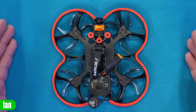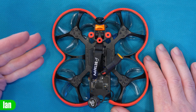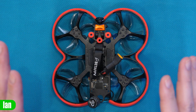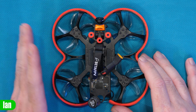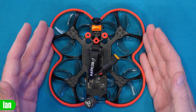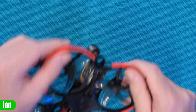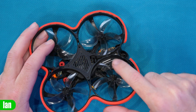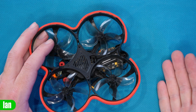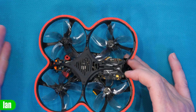The build is finished. I've spent quite a bit of time getting BetaFlight correctly configured — we now have 4.3 installed because there was a build for this flight controller, but there was quite a bit of configuration involved with the whole setup. It's all done now; I've installed a three-inch preset from UAV Tech and had to dial it back a little bit, but overall it's flying very well. We've got the HD Zero camera up front and the VTX in the back. I ended up using a piece of foam to hold it in place under the back frame rather than putting screws through the VTX — it holds absolutely fine with no movement, and it's easy to take out.